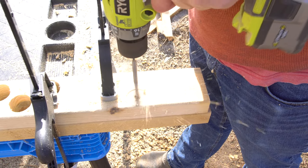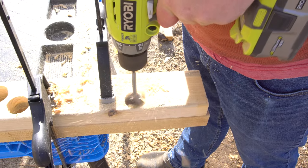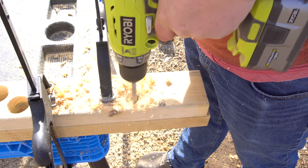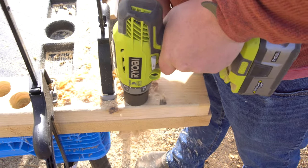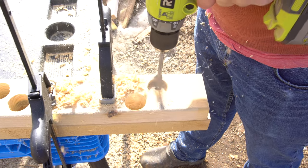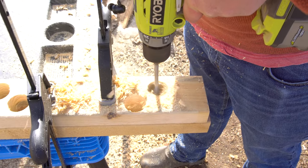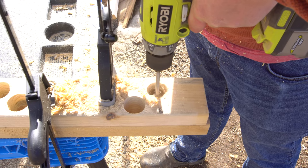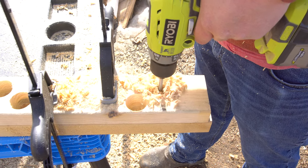The runtime on this particular drill is not horrible, but you're definitely going to be draining batteries quicker than with a brushless drill — because yes, this is a brushed drill. It features a fairly decent runtime with a 4 amp-hour battery, but you'll want one or two extra 4 amp-hour batteries for a large project or when using spade bits. This drill was able to drill six one-and-a-half-inch holes into two-by-fours at a fairly decent rate, and after the sixth hole I felt like I could do maybe one or two more before the drill needed a rest. Overall the performance of the drill is really reflective of its price — it's performing above its price tag but is starting to show its age, especially in the auxiliary handle, the chuck, and the fact that it's a brushed drill.